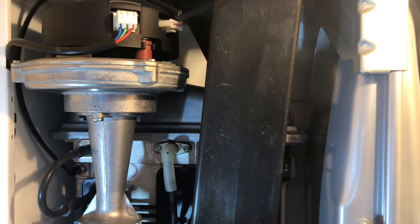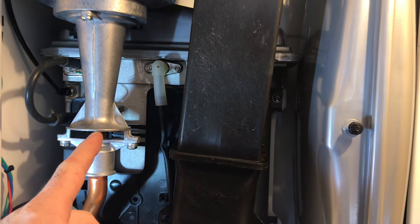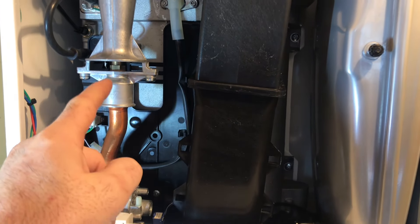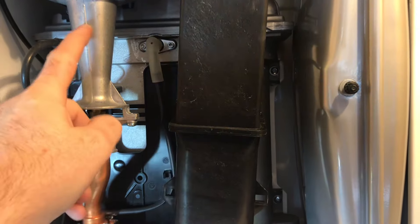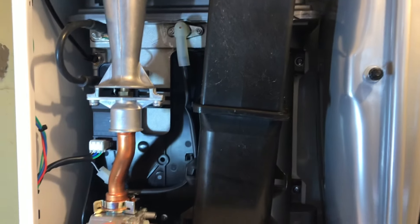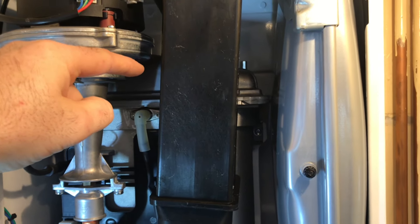The algorithm would send a pulse width modulation signal to the fan, which runs at full speed, drawing negative air pressure up the venturi and simultaneously drawing gas through the injector — it's a zero pressure governor. The negative air pressure in the venturi and the zero gas pressure from the gas valve work together: at full speed, say 7000 rpm, the airflow lifts the gas valve seat to maximum, drawing maximum gas through the injector. Gas and air mix in the venturi and are blown into the burner where they are ignited.